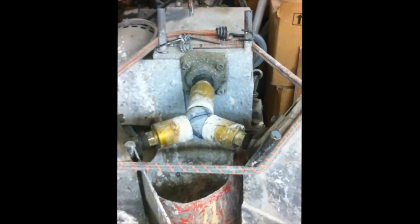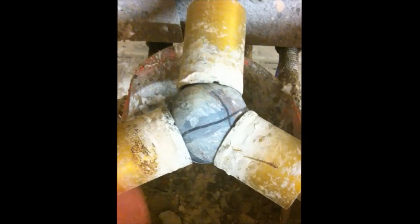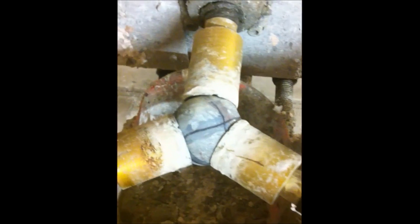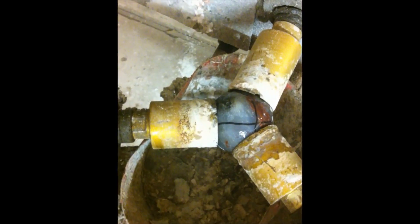We've got the sphere in the sphere machine and the bungee cords adjusted — not a ridiculous tension, but it holds all the heads in. Looking down, we want to be roughly centered with the sphere in between the heads. When we turn it on, we'll be able to see how it's rotating and adjust the heads till we get an ideal rotation. We also plumb in a line with a little metering valve so we can control our drip. You don't want a lot of water — put a little bit of a stream on it at first to get everything wet, then go ahead and turn the machine on.